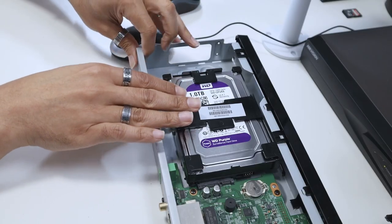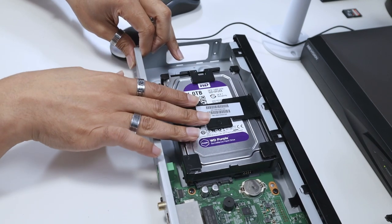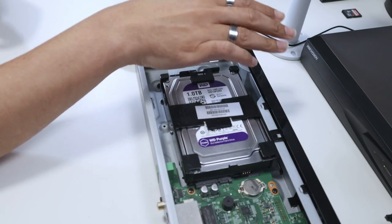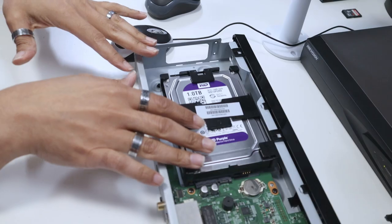You can also look inside your DVR or NVR to see if it's using the correct model, just like I'm doing here. I opened the equipment and I can see the model. It's Western Digital. I have a Hikvision NVR here also using the Western Digital WD Purple. Depending on the model, if you can't open it or don't want to, you can check via the menu if it's using the correct hard drive — though some models won't show you that information.